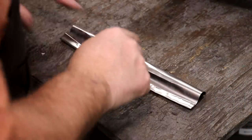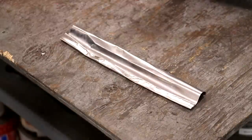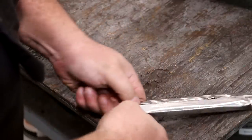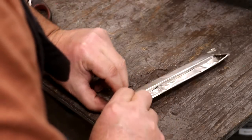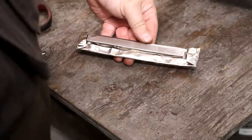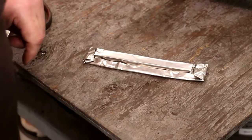We're going to wrap this thing up real nice and tight. Typically you fold it over a couple of times on itself — you're trying to make a more or less airtight pocket. I also want to put a little strip of paper in there: it'll burn out and consume any air that's in there. They make an argon kit for these ovens — you can flush the inside of the oven with argon from your TIG welder, putting an inert gas in there, which helps keep oxygen from oxidizing inside and keeps scale down. So we're ready to put this in the heat treat oven.